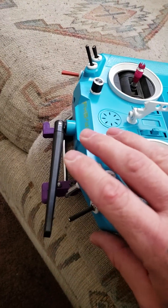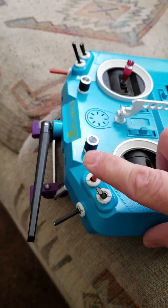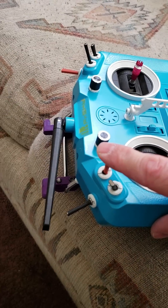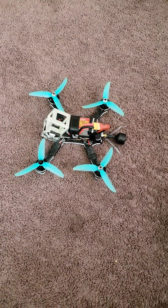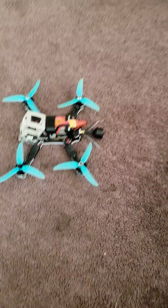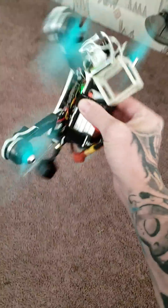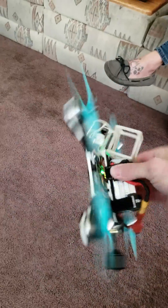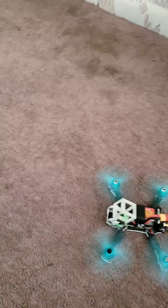I've got a pre-arm now. I left this one as an arm, but I set it as pre-arm. So that one has to be on first, and then this one, if I set it to the middle position, goes to idle up. Idle up has no PID loop — it just sits in a continuous loop, like idle up with the KISS stuff, but this is Betaflight.